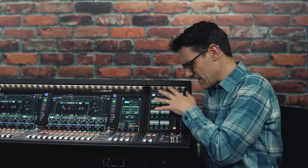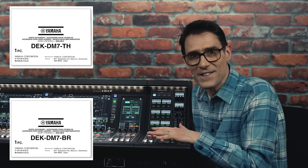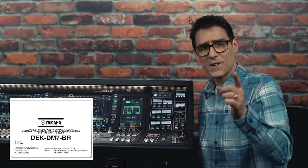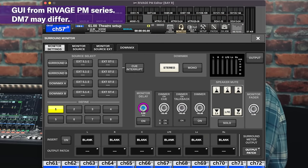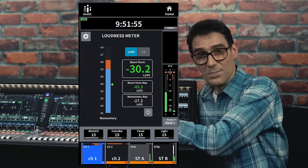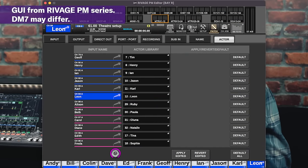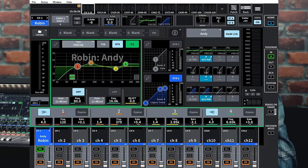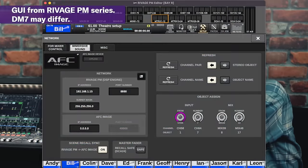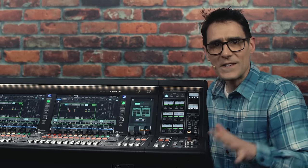The inclusion of this DM7 control panel also adds the special theater and broadcast packages. The broadcast package includes surround panning and monitoring, mix minus, audio follow video, loudness metering and more. The theater package brings RIVAGE PM's theater mode into the DM7 with the actor library and additional channel EQs and dynamics. AFC image control for immersive mixing is also included, though note that some of these features will arrive after a firmware update.